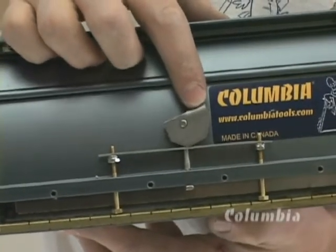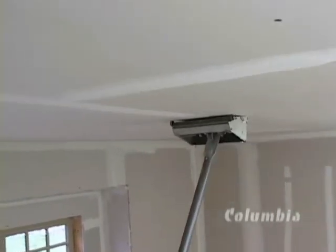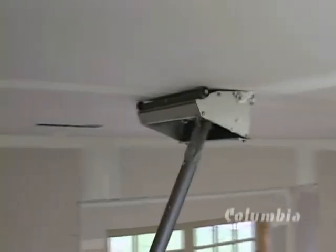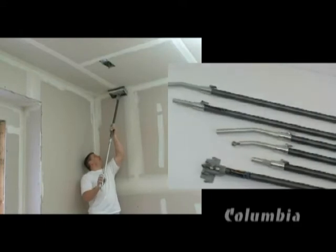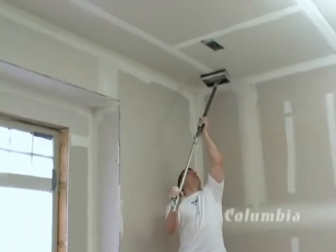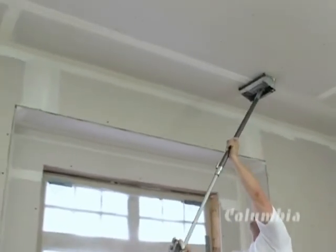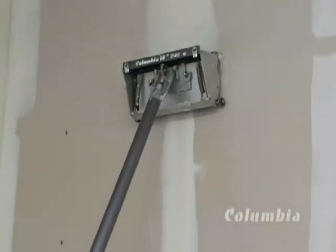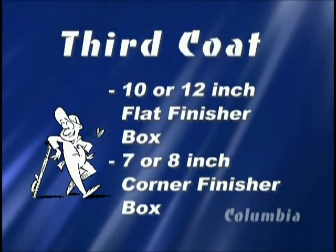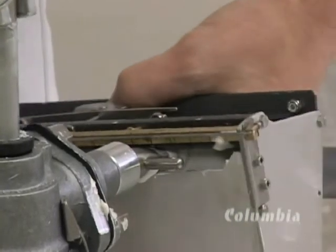The adjustable stainless steel blades provide the exact amount of joint cement required to evenly finish the flat joints. With various lengths of fixed or extendable handles, this tool can be used on vertical, horizontal, and ceiling joints. The flat box's unique design eliminates crowning and therefore greatly reduces the sanding process. The flat joints receive their second and last glaze coat, this time with the larger 10 or 12-inch flat finisher.